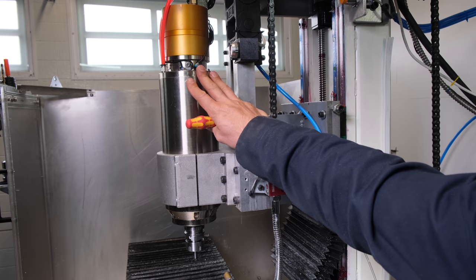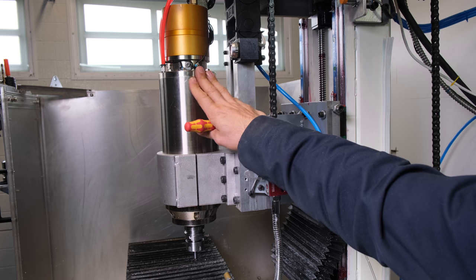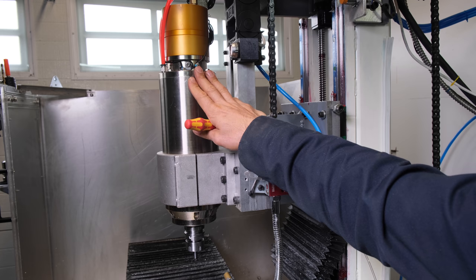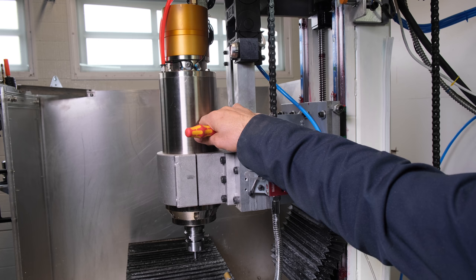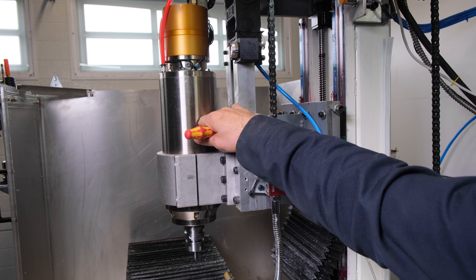One advice I have for anybody who's building their machine, if you're planning on building a heavy duty and stiff system and want to cut steel or heavy cuts of aluminum, don't cheap out on your spindle. Smaller and cheaper spindles have to run very high RPM and they have small shafts and bearings. Therefore, they are not suitable for steel or even aluminum. Do your research and don't let your spindle be the weakest part of your machine.